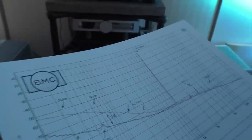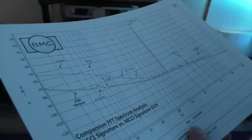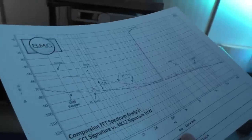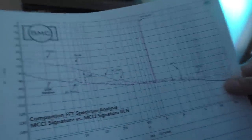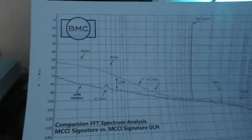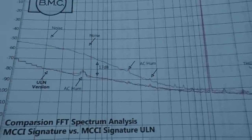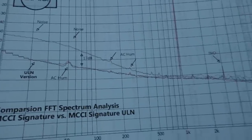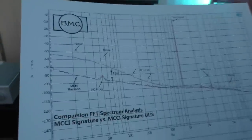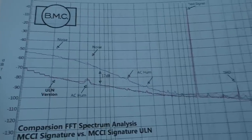Normally, right. And the regulated systems here for reference voltages are below the audio band. So the idea was, if we can force those regulations to be common mode in the audio band, but differential below the audio band, which is an exotic idea, then we could make the spectrum within the audio band disappear, which usually mixes up with the music signal. And that's what we did. Wow. And it succeeded at the first try. So sometimes it's just a nighttime idea. And once you know how to do it, you can see there was much more potential in this basic idea of the current amplifier.